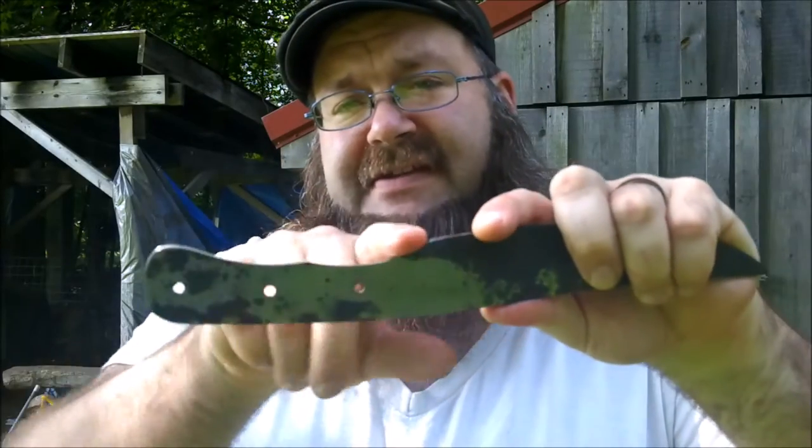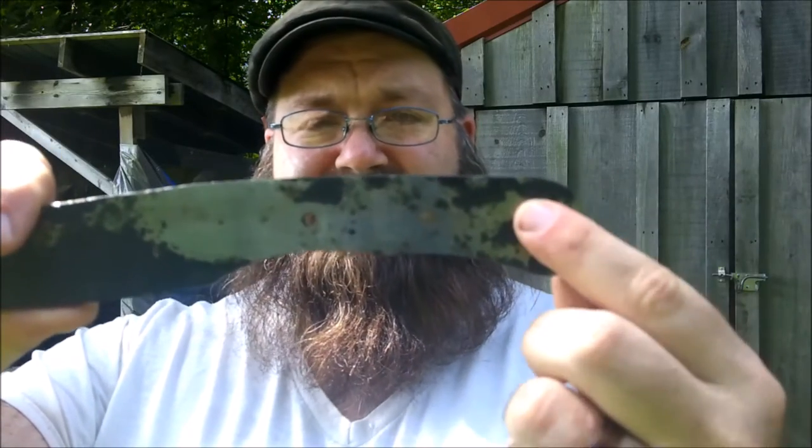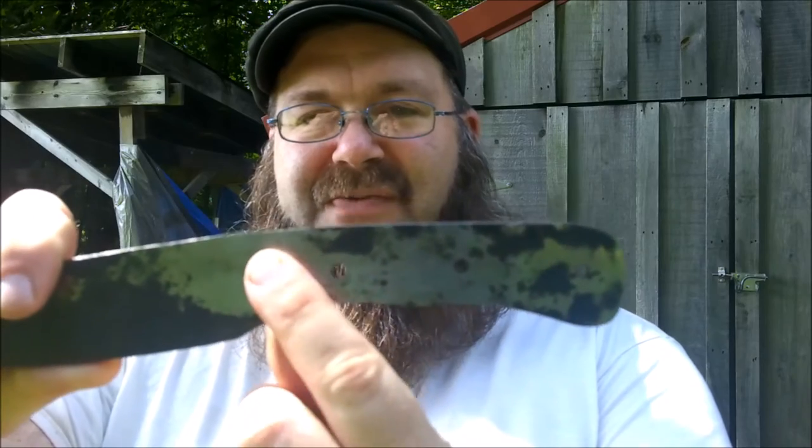These roosters were crazy today. But we're going to take a file, we're going to make this a deeper hole, so maybe it can act as a built-in guard. I figured out something I did really messed up. Look at the holes in that — there's one there, but I didn't center them. It should be one here, one here, and then one here. So I'm going to have to punch them and drill them all over again. We can do that before we harden it.